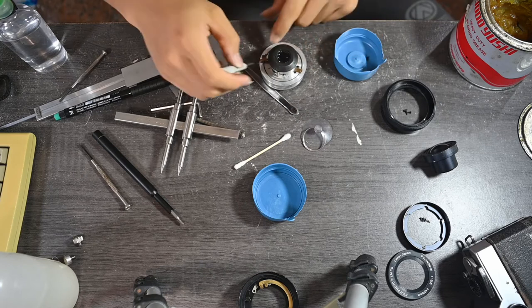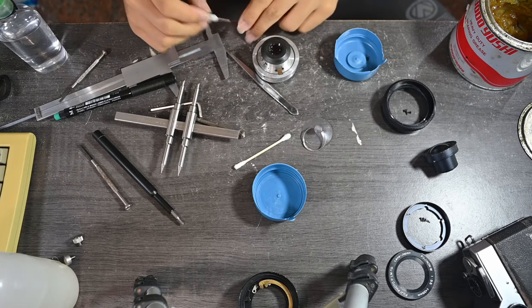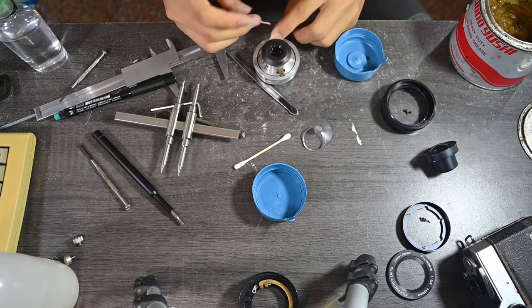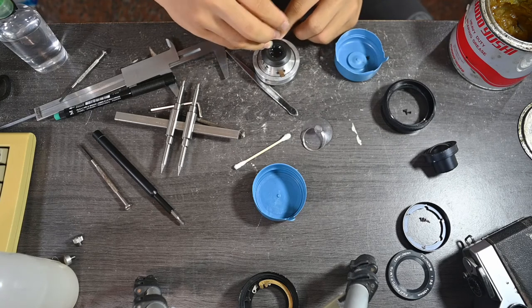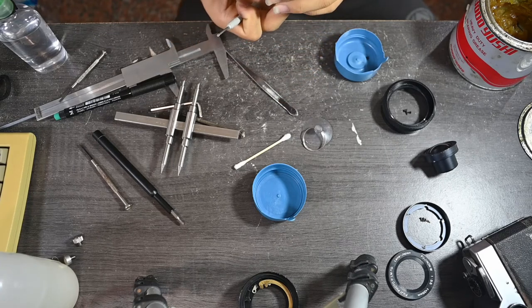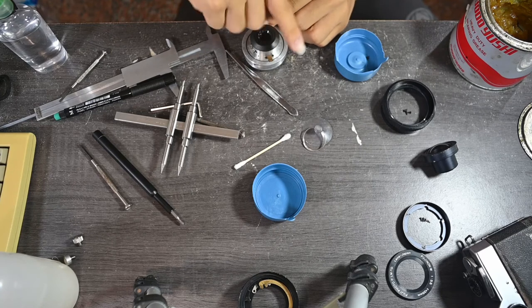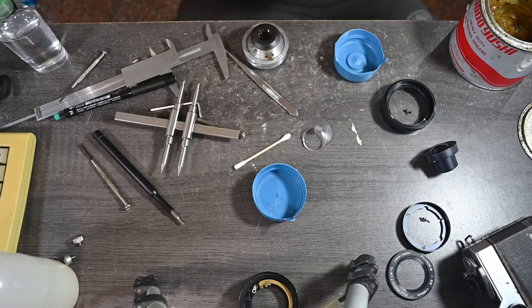I didn't wanna grease that rail immediately because if you put grease on the rail, like see now, yeah, it fell down. If you put grease on this thing right now, it's gonna like slobber everywhere. And if you have one already on, it actually holds the ring in place. And what that does is it lessens the likelihood where you have a rail jump out. It still can happen, but it's not that easy to happen. And even if it happens, you can probably control it and not lose position of the helicoid. So that is why. Just gonna take this last screw.